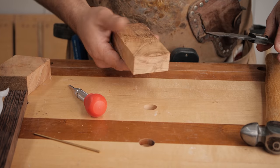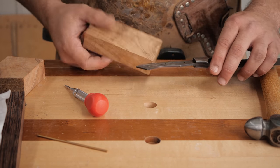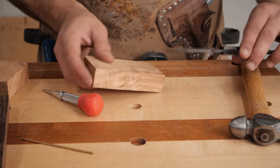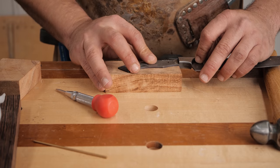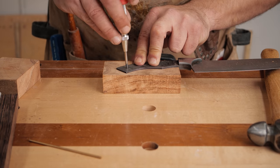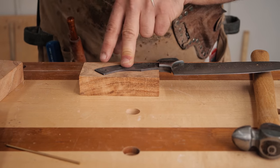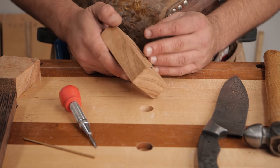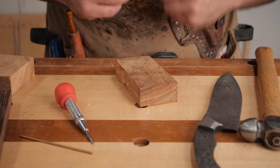Now that you have a square piece of wood — and if you don't have any woodworking equipment, you can do this with basically some sandpaper and a square block of wood — I traced it just to get a rough idea so I didn't cut it too far. You want to just take any square side and press it up against your ferrule there. If I'm saying that wrong, knife makers, you can correct me down in the comments. Now you want to mark where the holes are for your knife. We're going to center punch our holes here, then go over to the drill press — or you could use a drill — and drill these holes through. You want to do that before you separate your block, because that's going to allow you to have grain match on both sides and allow you to locate your two pieces when you go to do the next step.